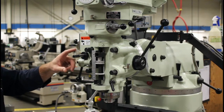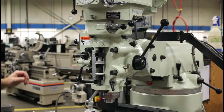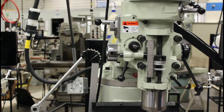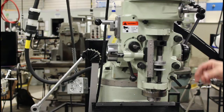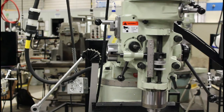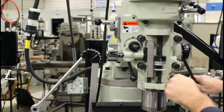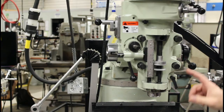Be very careful you don't hit this with a hammer because they break off really easily. When we come down, the quill jumps back up. If you're boring, you might not want it to pop back up. So what we can do is put a small amount of pressure on the quill lock — just enough to hold it into place. Do what you need to do, then lock that and it comes back up. Just a small amount of pressure, not a lot.